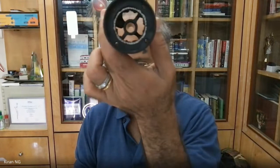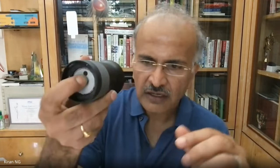Okay, since it is conical in shape, you can see the shape, it's a cone, right? Yes, sir. So then it gets fed. Depending on this, you can actually control how much gap there is between these two. This is also used in flour mills. You would have seen flour mills where they make powder out of wheat or ragi or even chilies. Yes, sir. That's how it goes. So they pass between two wheels which are very close to each other, which have teeth.